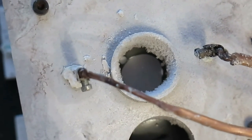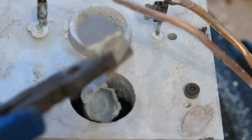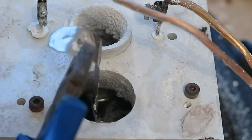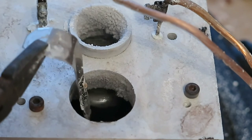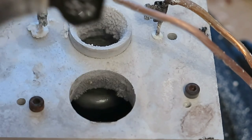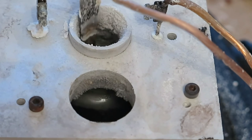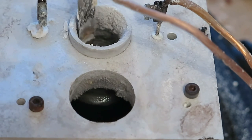In the collection tube there is a piece of molten sodium metal. To extract it I use a perforated spoon. The perforation allows molten salt to escape, thus keeping contamination of sodium chunks at minimum. Remember to always use dry and clean equipment when manipulating molten salt or metallic sodium. A drop of liquid water may lead to explosion or flame. I let the spoon sit in molten salt for a few seconds to heat it up and dissolve solidified salt. This spoon was left in air for about half an hour and the reaction was quite vigorous, as sodium hydroxide is hygroscopic. With the perforation as shown, it is also easier to pick up sodium drops.